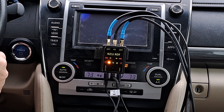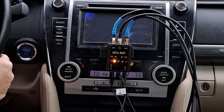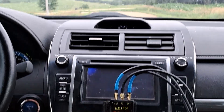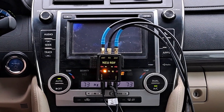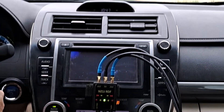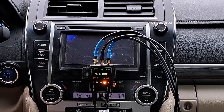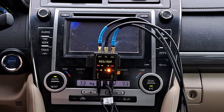Right now we're listening to NOAA weather radio out of St. Paul, Minnesota. It's a little bit to the left of forward of us, and you're going to see most of the time the light is to the left. When you go slowly around this curve coming up, we're going to watch the LED kind of go to the middle as we get facing the transmitter. There we are — so we're partway through the curve and we're facing the green LED now. As we continue through the curve, the lights on the right-hand side are going to be on more often, indicating that the transmitter is to the right of us.